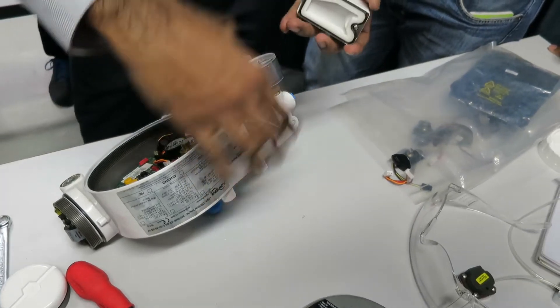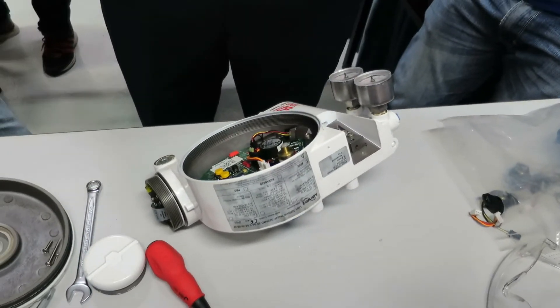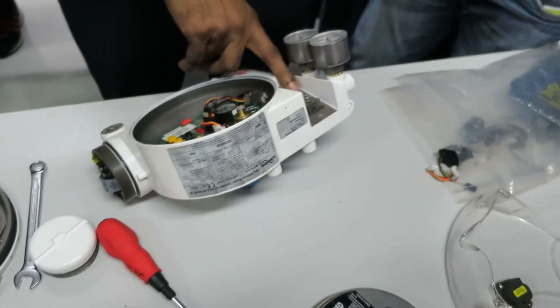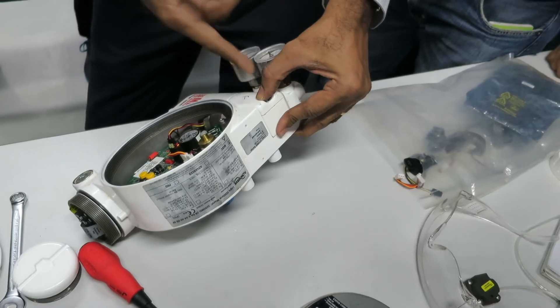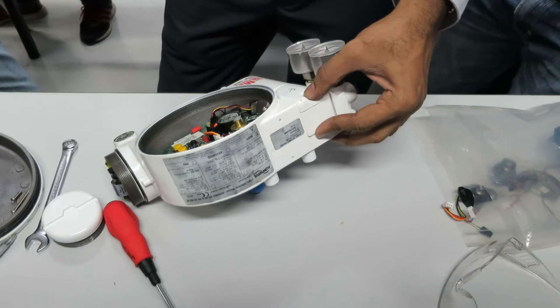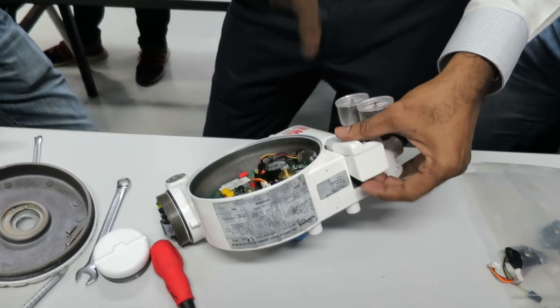For example, water can go in this way. That's why before commissioning, you also need to check whether the spool is corroded or not, because the water goes in and stays there for maybe a few weeks. Then after temperature changes, it will cause corrosion and oxidizing. So just to make sure — if the valve is not responding, the first thing to check is the spool.